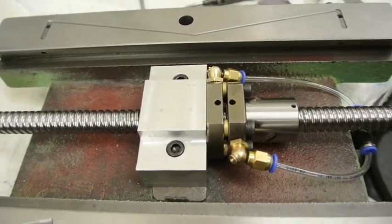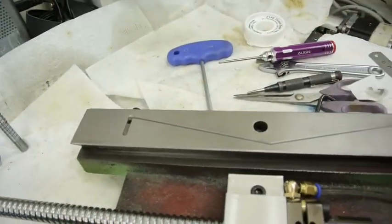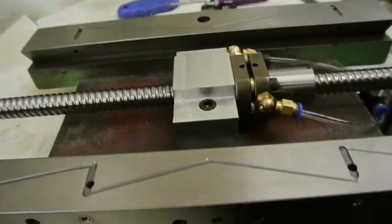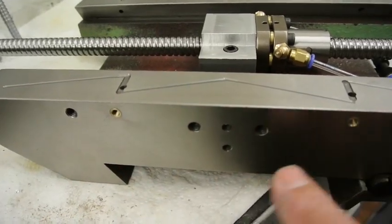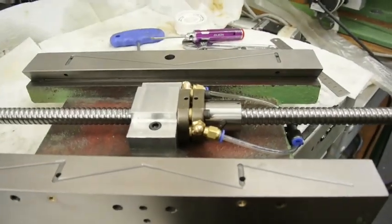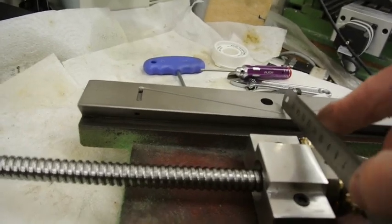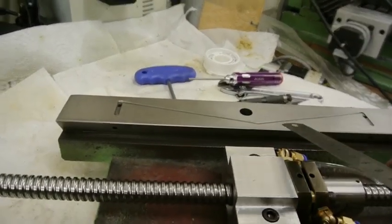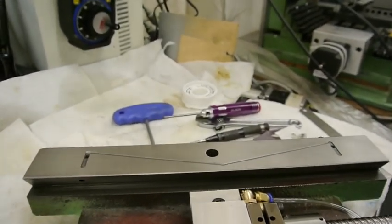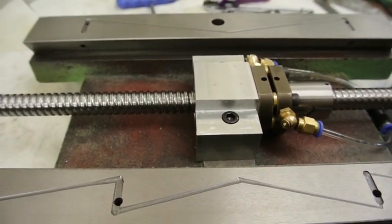The other thing I've had to do is put in the oil ways. There were two oil ways in each side when I got the mill, so I've made up additional oil ways and I'll join the holes that feed them here with two screw fittings. What I'll do now is fit this into the mill. You can see it does go in, but the only snag is that this is over the height of the side here, so the table has to be tilted and the gib strip has to be removed and not put back in until the table is inside the little section at the ends of the table which hang down.